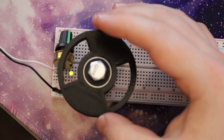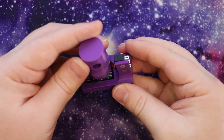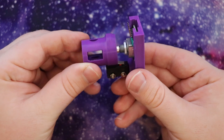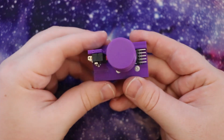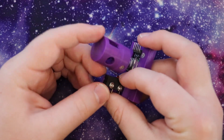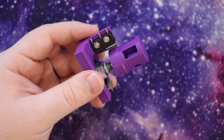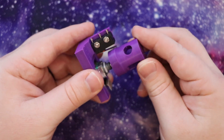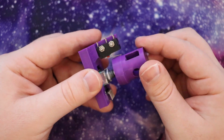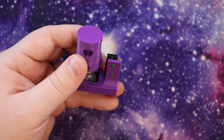This issue can be alleviated somewhat if you add an absolute reference. I made a prototype several months ago for a wind vane that uses a rotary encoder and an end switch as its reference. A small protrusion on the plastic attached to the encoder is just wide enough to close the end switch, so you can calibrate it so that the end switch points north. The downside is that it still requires constant power. If it loses power, it has the ability to recalibrate itself, but the device has to wait until at least one click of the end switch is made — and if the wind consistently blows east to west and never touches north, it won't calibrate until who knows when.